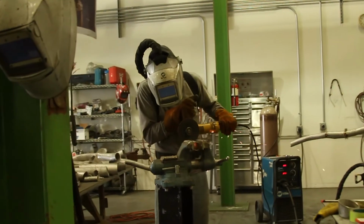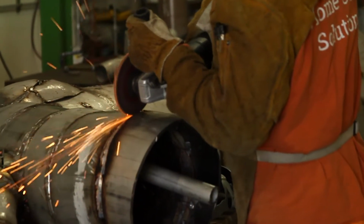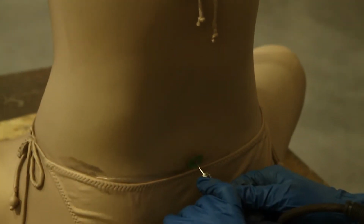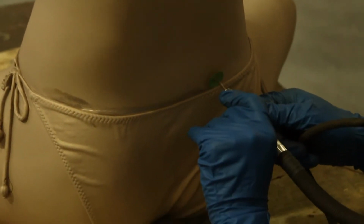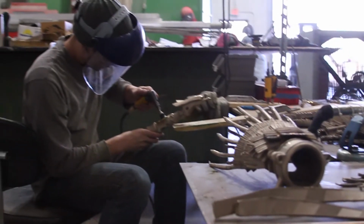My grinding and welding is, I try to make it invisible. We're actually trying to make our grinds and welds look like they're not grinding and welding. We also have to then chase those welds back or use grinders, hand tools, things like that to remove the weld. Essentially, a metal chaser is in the same line as a fabricator, where you're basically manipulating metal to make it look like the right form, its finished final product.